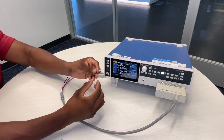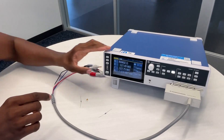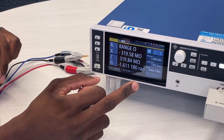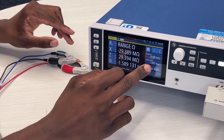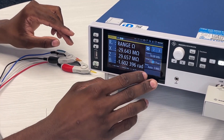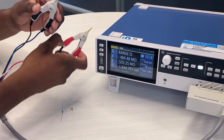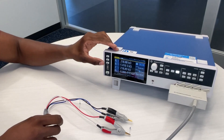The next step is to measure resistance. To start, make sure that R is lit up and selected for functions. Then in the top left corner make sure it's RSX for resistance and reactance. Then down here pick Z theta R for impedance and phase angle. From there make sure the frequency is around 10 kilohertz and voltage level should be 1.3 VRMS. An auto function for the range should be fine as well. From there you connect the component to the device.